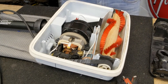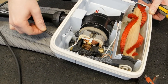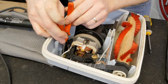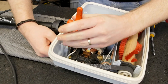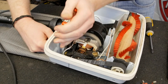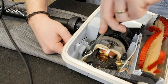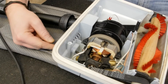With the motor cover removed, we can see the cable clamp that holds the main cable in place. To release that, I'm just going to take a pair of pliers and pinch the two tabs, which should release the mains cable from the back of the machine. Then you can just use a screwdriver to push the wire down if necessary to angle it out.